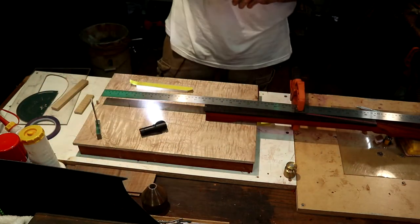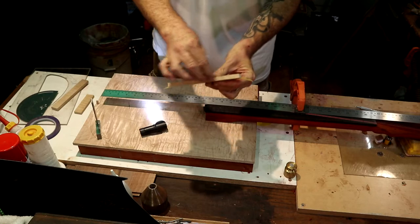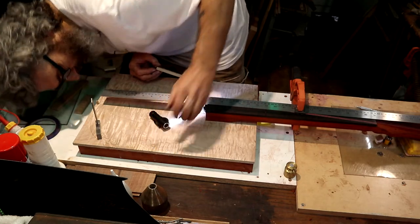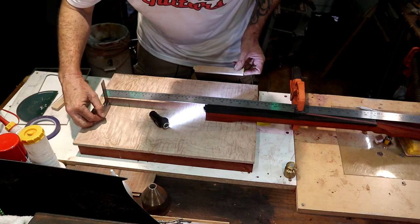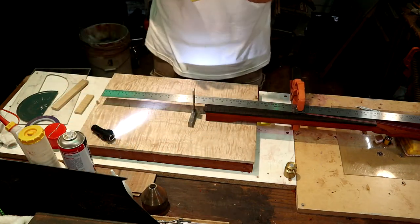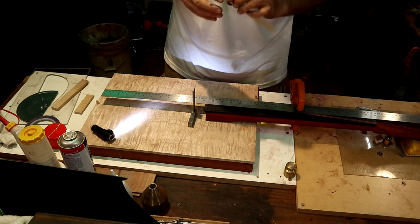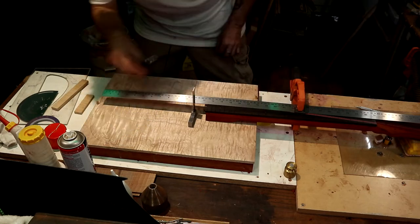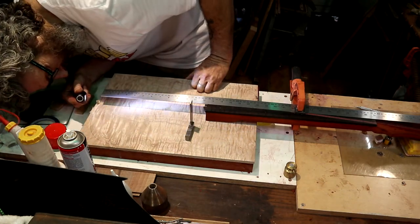Burnished. Let's put a little super glue down on the strip of tape on the body. This is my jointed edge, so I want to double-check that I'm in the location I want to be. Let's hit that with a little activator. Make sure you're putting the jointed side of your wood up against the neck — in this case both sides have been jointed. We'll check one more time to make sure I haven't bumped anything. We look really good. No gap — I'm good.